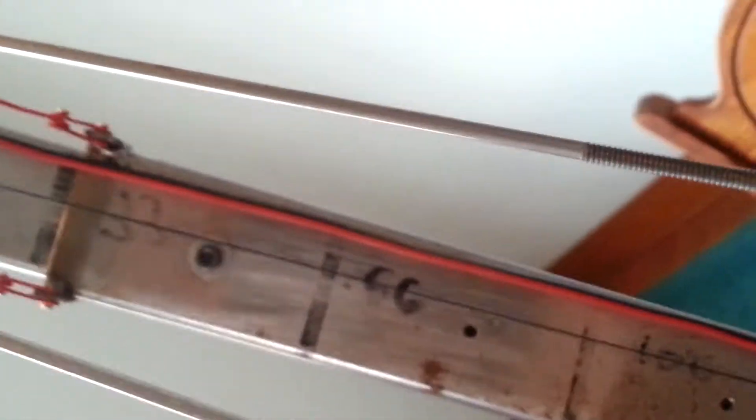This is a telescoping boom. There are wear pads in every section. This boom is a prototype and it can be pinned at one hundred, sixty-six, or thirty-three percent. Or zero. So that would be sixty-six percent, thirty-three, and of course one hundred — one hundred forty foot of squirt. And this is another one hundred forty foot of lattice.